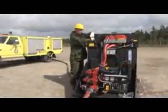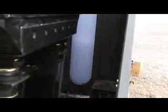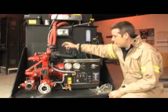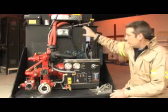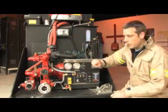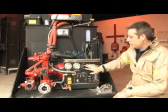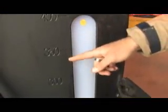There's two ways to put some water into the pump. The first one is using the tank. There's a valve here, which is the tank to pump valve, that needs to be open to bring the water into the casing of the pump. So using that, obviously, you don't need to prime the engine. It will self-prime with the gravity of the water.